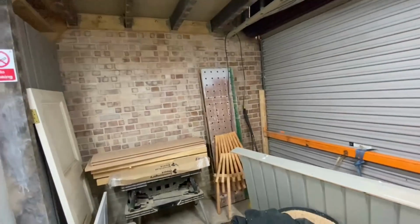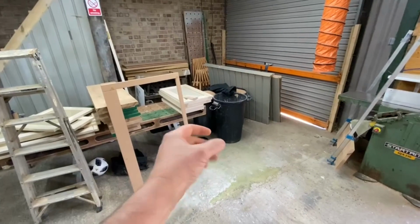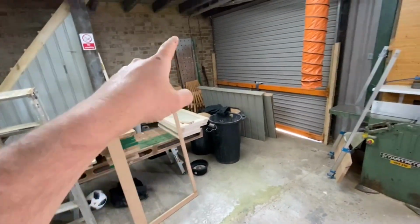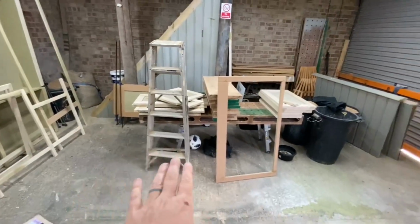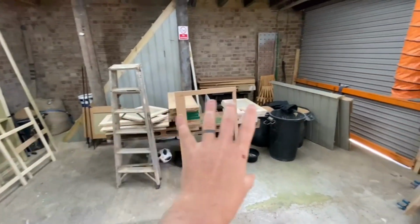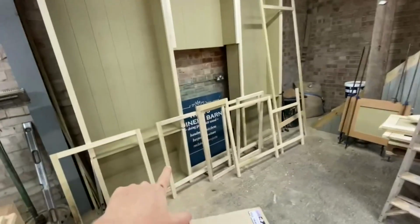I might make some more because they might not be wide enough, but I could put those on kitchen legs, adjustable plinth legs. Have 2 or 3 of those, clip them up on the wall somewhere and then drop them on the floor, and put my units on those as and when I'm building rooms. If I'm building an L-shaped kitchen, which is what I'm doing today, I can do that. And it saves me putting the legs on the units, which I always have to do because I want to build the units up high enough to click my face frames on.